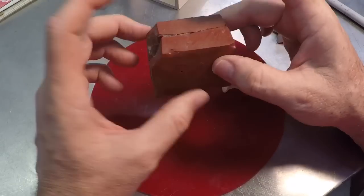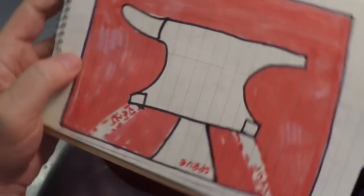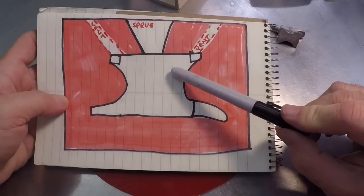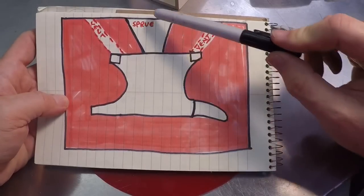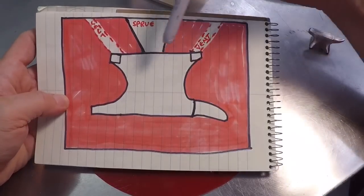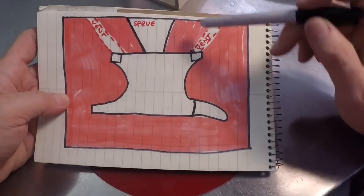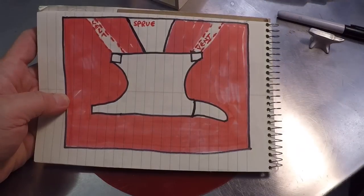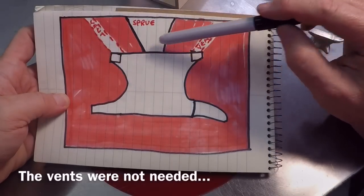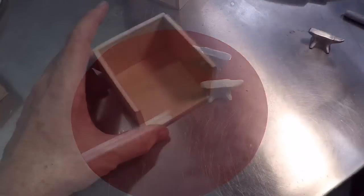So today I'm going to make a new mold. I'll orient the anvil upside down with the sprue coming in through the bottom — that's a nice flat surface I should be able to cut off and clean up relatively easily. I'll leave room to add a couple of vents if needed. I think if I make my sprue hole big enough the gases should escape without vents, but I'll leave room for them just in case.